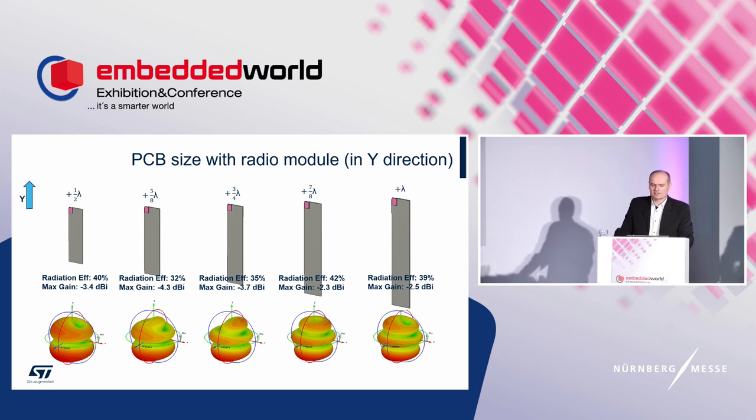The board extended in the y-axis maintains impedance in the band, with possibly worse numbers in the band corners. Radiation efficiency and maximal gain float depending on size. A small-sized board has not enough counterpoise and thus low efficiency, while large boards have a highly fragmented far field.